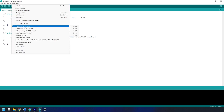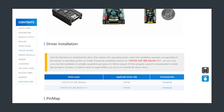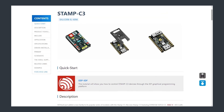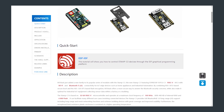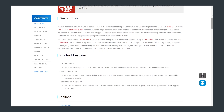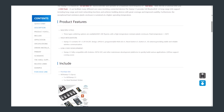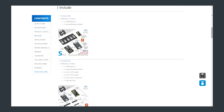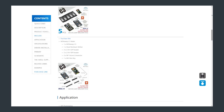We can also select lots of other settings and configurations, such as CPU speed. You might have to install some USB drivers for the CH9102 chip — I didn't have to for some reason, but if you do, there are instructions in M5Stack's documentation. Speaking of documentation, there is a fair amount. The board schematics are available, which is better than some other boards we have seen — the Seeed Studio WIO RP2040 had almost no documentation. But it would have been nice to have seen a bit more information, or maybe some examples for beginners to get started.